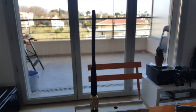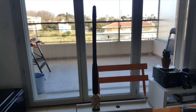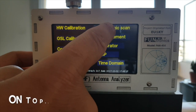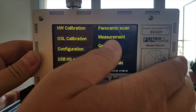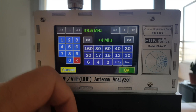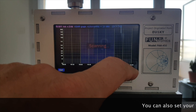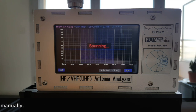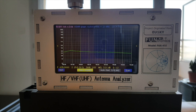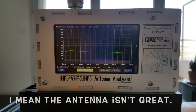I want to make sure the UHF scanning does work, so we're going to scan this antenna — the VX7R antenna — which is supposed to cover VHF and UHF. Sometimes the touch screen doesn't quite work well. We'll set the band; I'll choose 70 centimeters — 425 plus 20, that's going to be 445. It shows a 3.3 to 1 SWR across the whole band, which really isn't that great.